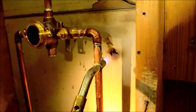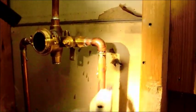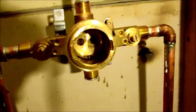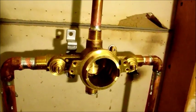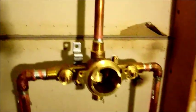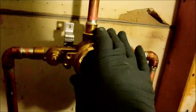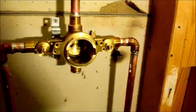All that excess stuff will come right off — put a little heat on it, or if you don't like it you can actually scrub it off with a brush while you're putting heat on it. But like I said, I'm more about form over looks than anything else. That's basically it — that's how to, as they say, sweat pipe. I don't call it soldering pipe because sweating is what I'm doing. The next step would be if you had a plug — this one didn't come with a plug — you'd put it on temporarily until you're done with your tiling. You'd turn on the water, make sure all your connections are good and watertight. I don't have a plug, so I'm going to wait about 20 or 30 minutes for this to cool down. You don't want to melt anything, so I'm going to wait 15 to 30 minutes, put the cartridge back in, lock it down, turn on the water, make sure I've got no leaks — and that's as simple as that gets.